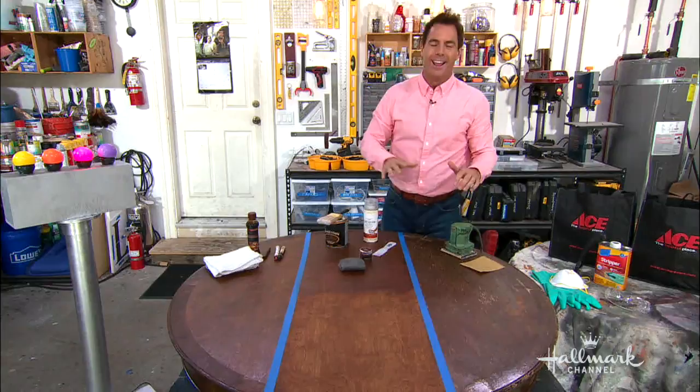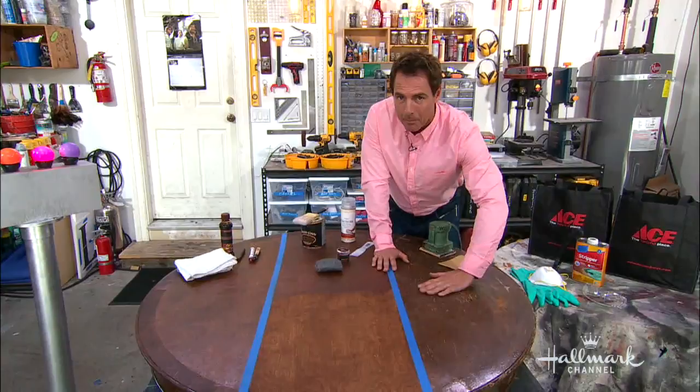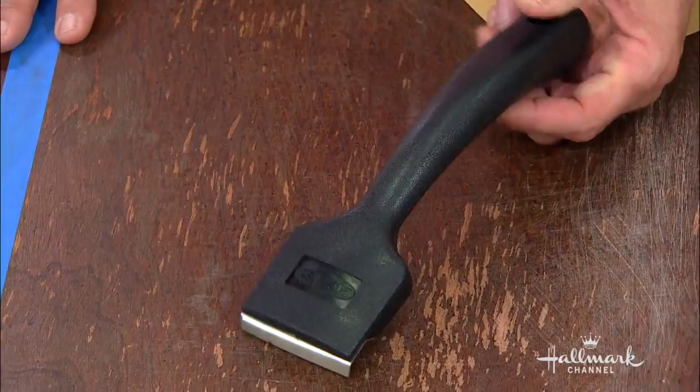This is if you've been very bad and you haven't taken care of your furniture like you should have. Don't panic — here's the goal: we want to take this surface back to its original state. The varnish is starting to wear off, the stain is starting to get faded. If it's a painted surface, you simply pick up a paint scraper at your convenient hardware store and you can begin scraping off the paint.